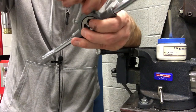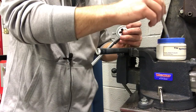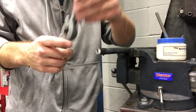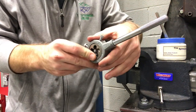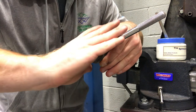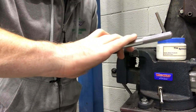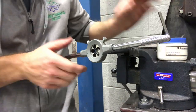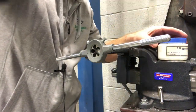I'm going to install it into the tool and tighten down these screws just like so. Apply some oil to this end here, making sure that it's fully coated. I'm going to place the die up to the end, apply pressure, and start spinning it. You can see that it's starting to grab.